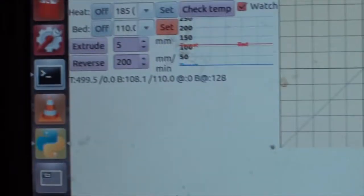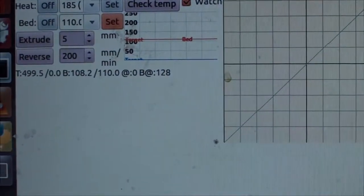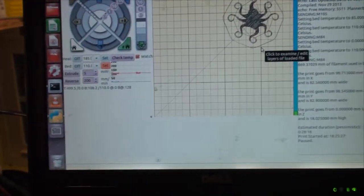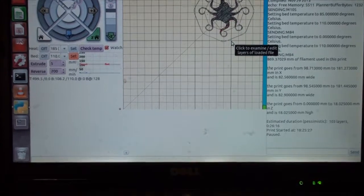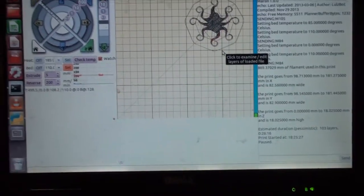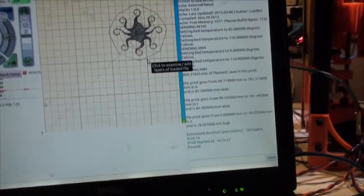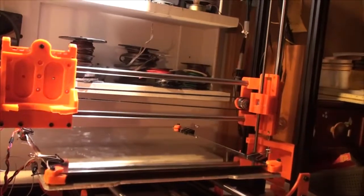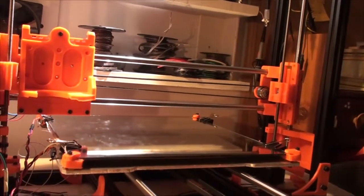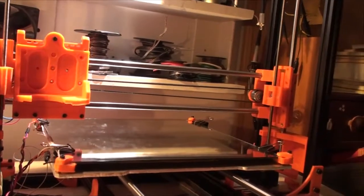Okay, it's been 35 minutes and I've just been browsing some forums. And I'm up to 108C. So that's great, but what I've been reading on some forums is that people have been going anywhere from 80 to 110, so I'll have to figure out what works for me if I ever do end up printing ABS. I suspect that 100 degrees C will work on this, because it's a glass bed, and you really just are worried about first layer adhesion and warping, so there are so many other variables that come into play, which is what I've read.